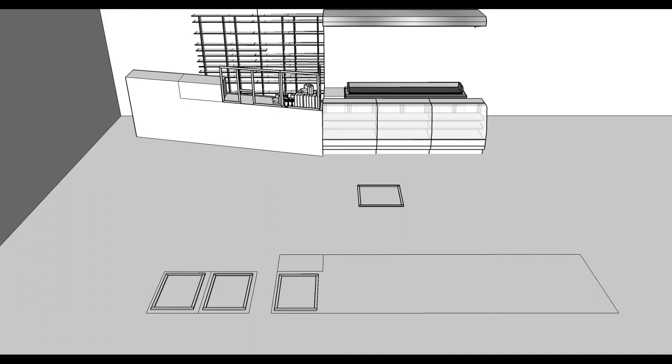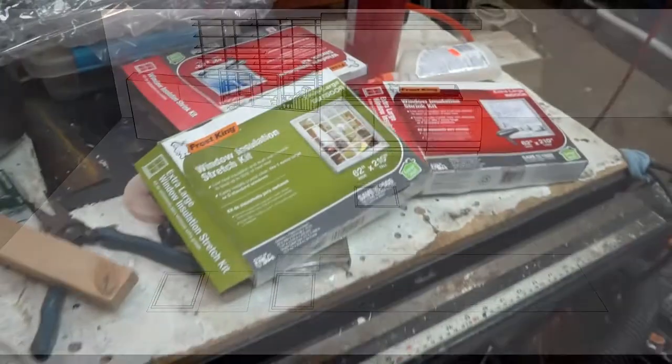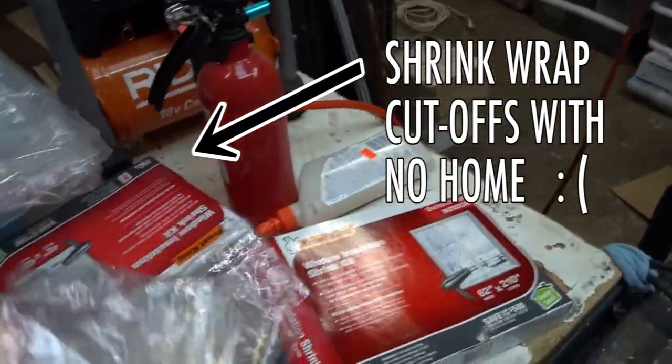First of all, 26 plus 26 is 52. Our width on that smaller piece is 42. But in addition to that, you never really have the same size. It's always different sizes, so my point is that the size plastic right there is an awkward size. You're rarely going to have a panel you need that size, and generally, you're going to need something bigger. So that's the economy: the bigger sheets are better. They produce considerably less waste.